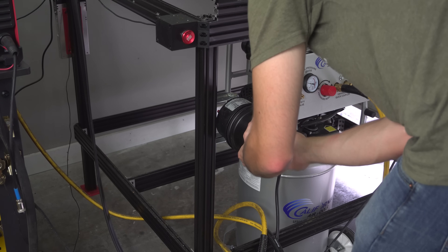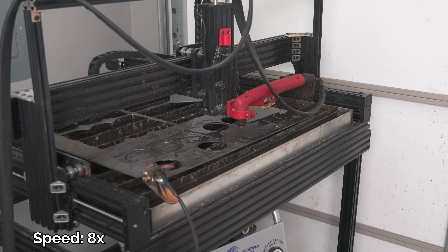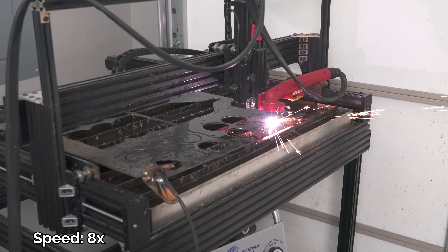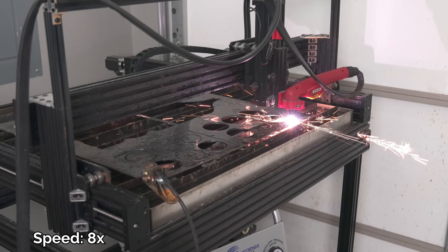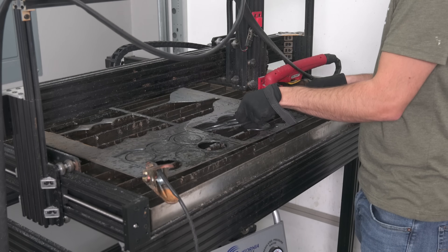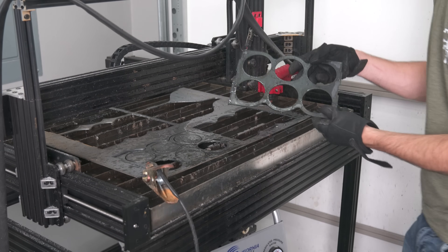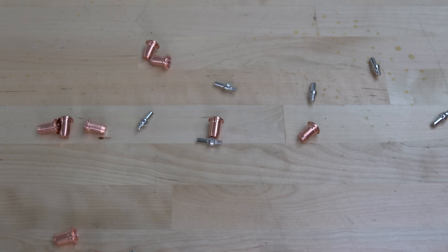I'll pop in a replacement filter, but unfortunately these filters have to be replaced often. With my setup, I'm having to change the filter after about 5 hours of cutting, and these toilet-paper-roll-looking filters are not cheap. While I'm recutting that piece for the beer caddy, I have to say that short consumable life appeared to be a characteristic of this plasma cutter. Even with a new filter, I was getting about 45 minutes to an hour of electrode life on future projects. In contrast, I never replaced the electrode on the Cutmaster 40 and ran that plasma cutter for many hours. Fortunately, consumables for the IPT40 hand torch are really cheap, but it is a hassle to keep changing the electrodes.